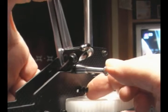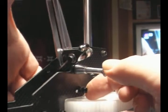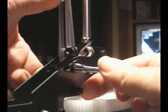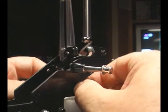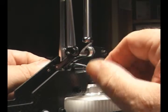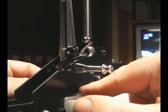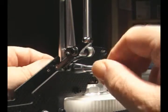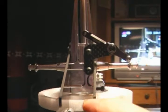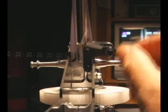Conventionally, you bend back a plastic anti-rotation device, but there's no way you're going to be able to bend this, so that's why you've got to have this tilt system. So we'll do that up loosely now. We'll Loctite our canopy mounts, and then we'll loosely do up the bottom bolt until the swash plate is mounted. And that's the rear view of our anti-rotation device and mounted elevator lever.